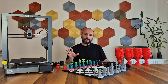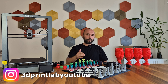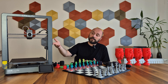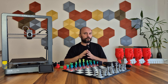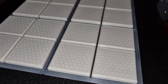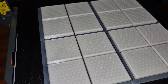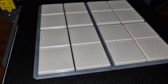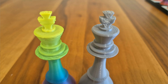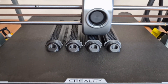When evaluating from a time performance perspective, a printing time reduced from 9 hours 24 minutes to 4 hours 50 minutes is quite successful in proportion to the resulting quality. In my view, the Version 3 Plus passed all the tests. While it was adequate in some areas, it was quite good in others. The parts I considered adequate had slight ripples on some models. Perhaps if a linear rail had been used instead of a steel shaft on the bed, these errors might not have occurred. However, I like the leveling of the bed — it's not perfect but largely successful. The two powerful fans do their job even at very steep angles, and the extruder system works very well with the unicorn nozzle.